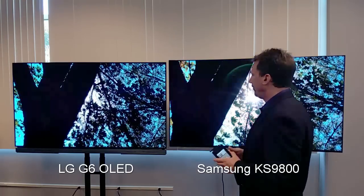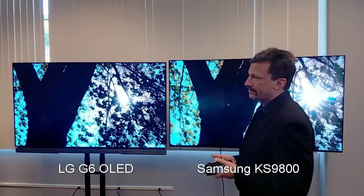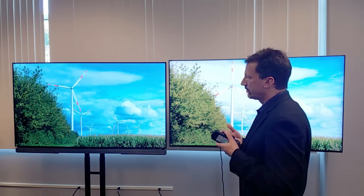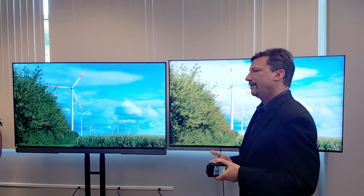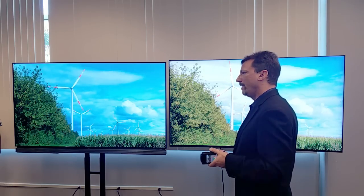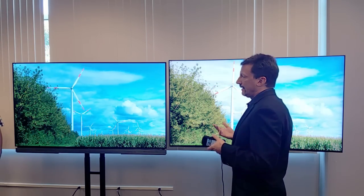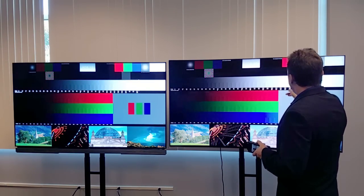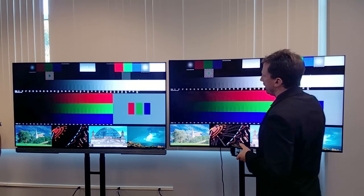People love to talk about the dynamic range of OLED. Another thing that's really important, though, is peak brightness. In the absence of peak brightness, there's just a tremendous amount of data that you're not able to display. With quantum dots and their high efficiency, we're able, at the same power budget, to help television manufacturers make a brighter set. At the high end, we basically blow out the brightness spectra above a thousand nits.